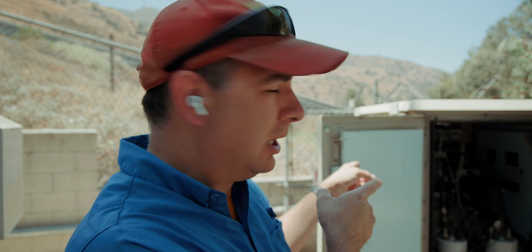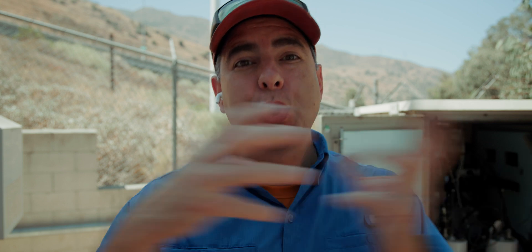We're out at Prado and have the box open here and I have the transmitter ready to go. So the old transmitter is just unplugged - I just unplugged it right now. What we need to do is remove that old transmitter, undo all the connections, pull it out of the rack, put the new one in the rack, and start making all these connections and configurations.